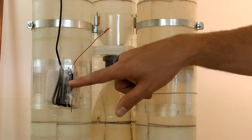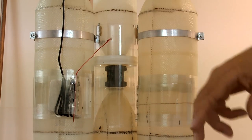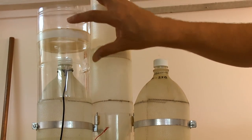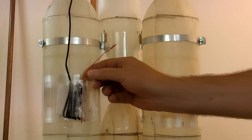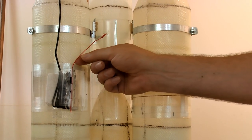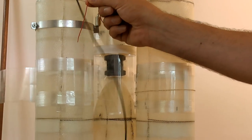For this test, we've got the parachute mounted on the side of the rocket, but for the final rocket they'll be mounted in the space between the booster segments. The parachute is simply held in with a kind of door hinge mechanism. So as the booster releases and the sustainer pulls the wire out, the parachute falls out.